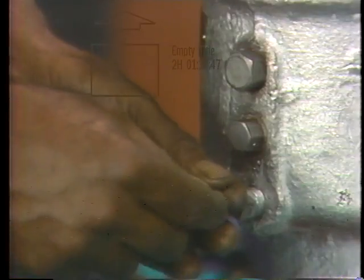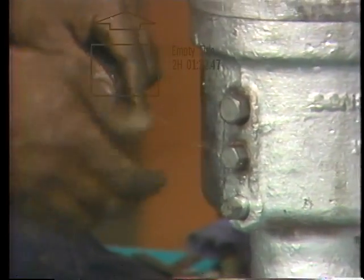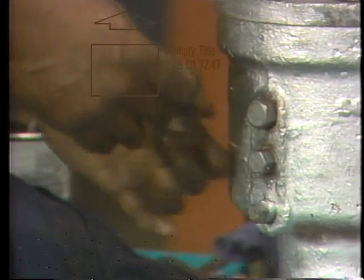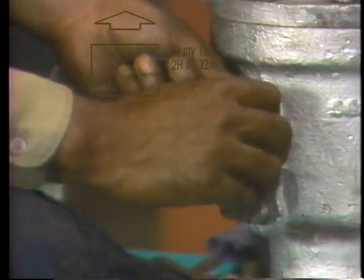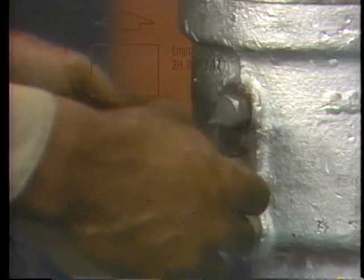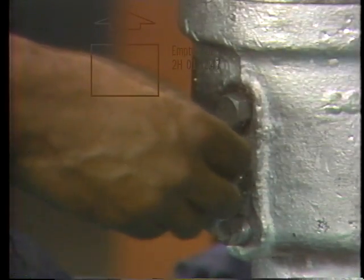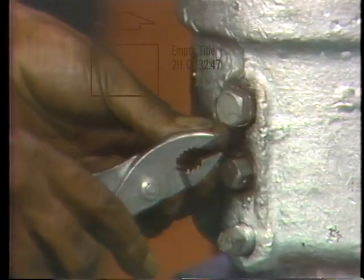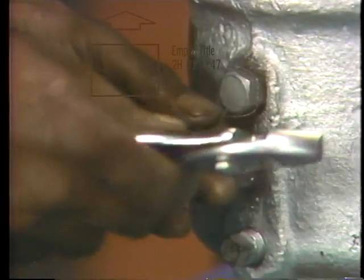All that remains is to attach the lock wire to the adjusting ring locking pins. The wire is first threaded through the hole in the head of the lower pin, then twisted together to form a single strand. One free end of the wire is fed through the hole in the upper pin, and again the ends are twisted together. To lock the wire in place and serve as a signal that the rings are properly set for operation, a metal clip on the end of the wire is secured around the wire close to the lower pin, and squeezing the clip with pliers locks it in place.